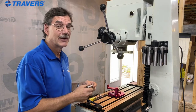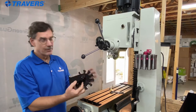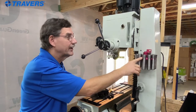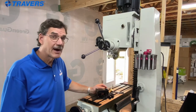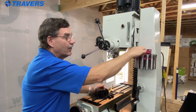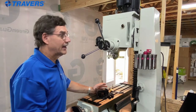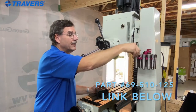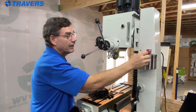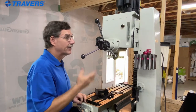So we found a solution for you. The solution for the conventional carousel-style collet rack is a collet rack that's not even for R8 collets — it's for a spring collet, an ER25. It has to be the size 25, but the R8 collets fit right in there. And by the way, all 12 collets fit in the same rack. There are also three additional spots where you can put another R8 collet, shank, or anything like that. It's not an R8 collet rack — it's an ER25 collet rack — but it works perfectly.